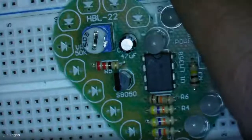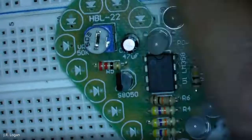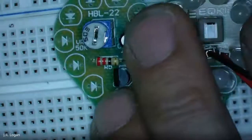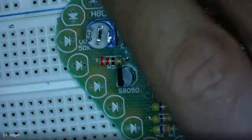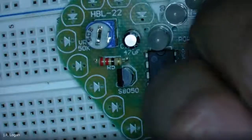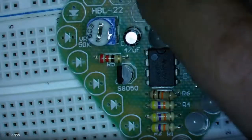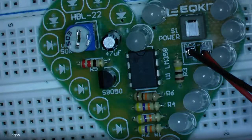You would print up one of these boards. It would be populated by a pick and place, and it would run through an oven where everything would have this paste on it, typically applied through a mask so you're applying it only in the right places. Then part of that paste evaporates away, the solder remains, and all of your components are soldered to the board at one time. This also makes it very hard to repair those sorts of things. I have heard of people just heating and remelting if they had a loose joint, but mileage may vary.